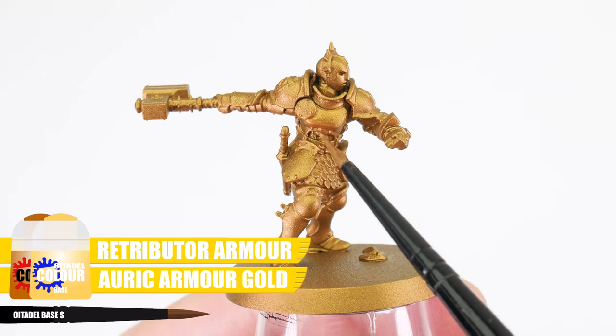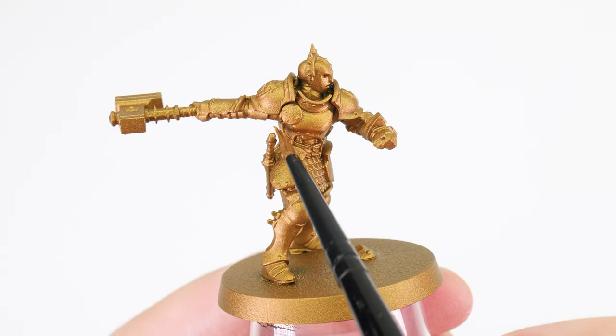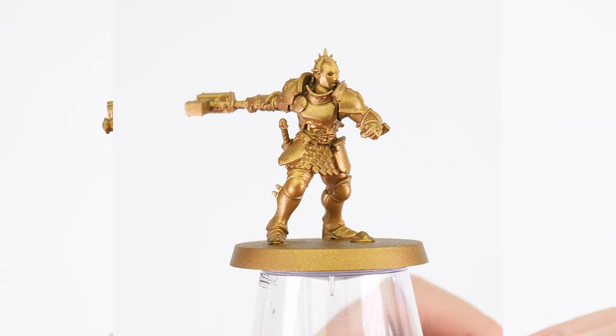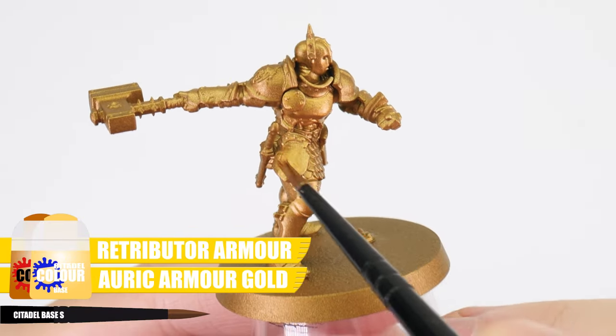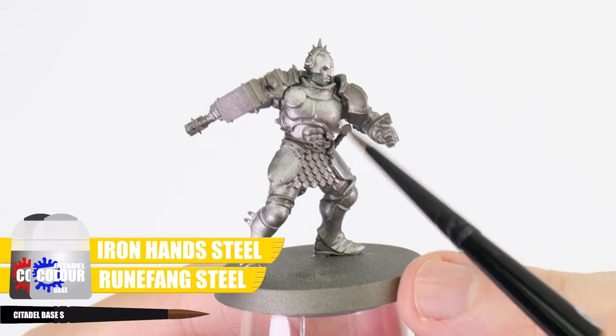When you're ready, we also want to keep our brush moving and avoid going over anywhere we've already painted, to prevent creating any unwanted texture whilst the paint is still drying. And because we thinned our paint it won't have covered very well — but don't worry, we just need to repeat the process and continue to build up our layers until we have a solid colour. Just be sure to let each layer completely dry first before doing another one.